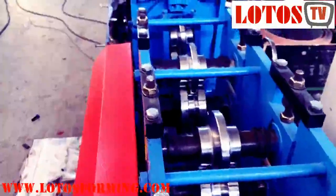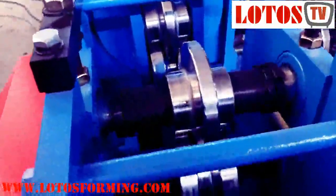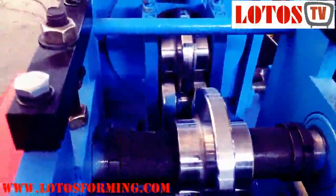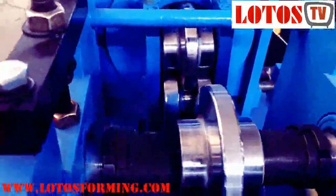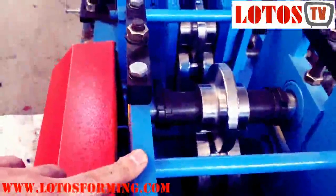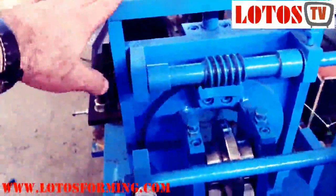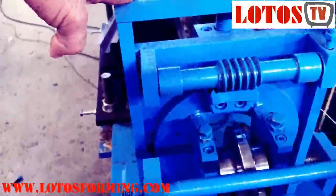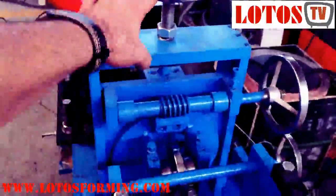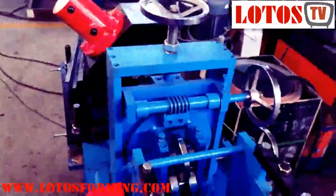The profile is becoming more sharp and deeper as we progress. Let's go to the final stations — the final rollers. Up to the profile that you give us, we design each roller accordingly: how many stations the machine has, what the shaft size is, what the machine's power is. Profile, everything is designed according to your profile and material thickness. This is the final adjusting unit we use for twisting and elbow alignment — it can move left, right, up, and down. By this adjustment we can put the whole line left and right: three-axis adjusting.